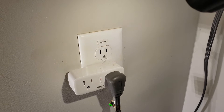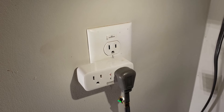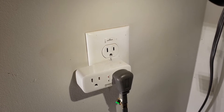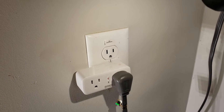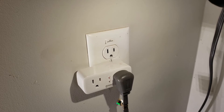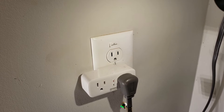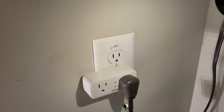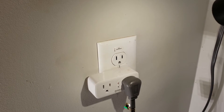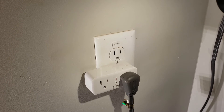So even if you are home and in bed asleep, you can schedule the outlet to turn off, which will turn off your water heaters overnight so you don't have to heat water that's not being used. And you can have it scheduled to turn the water heaters back on when you get up in the morning. This limits the amount of time your water heater is allowed to operate. Personally, our water heater operates only a maximum of six hours a day and we have never run out of hot water yet.